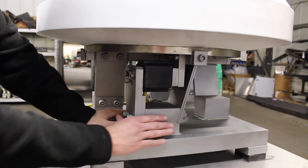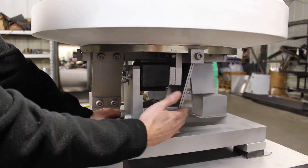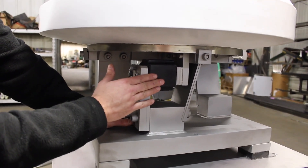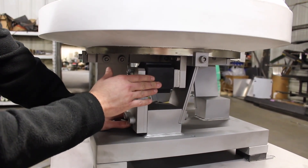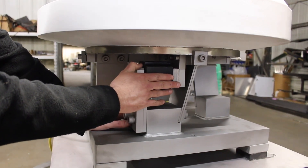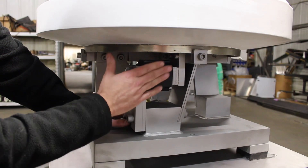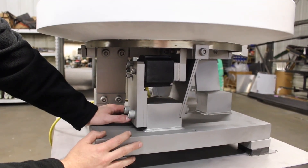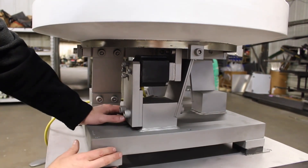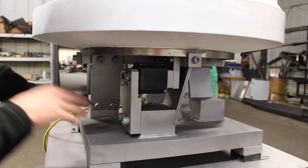The general principle on how a vibratory drive works: the springs are basically holding your tension, so they hold your frequency. The more springs on, the higher frequency you're going to go; the less springs on, the lower frequency. Your coils are driven by an amplitude control — usually a solid state control, variable transformer, or a VF multiple frequency control. It's an electromagnetic coil with a winding, just pulsing. You can run them at 60 hertz, 120 hertz, or in the VF category, anywhere. A spring flexing this way creates rotational motion of the unit and drives the parts in a radial orientation.